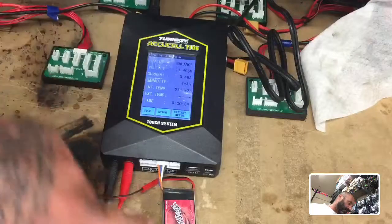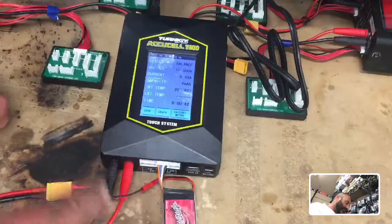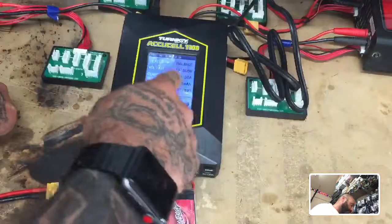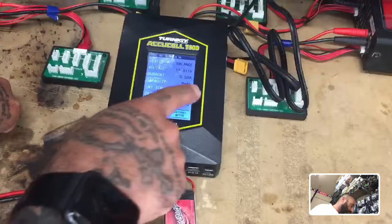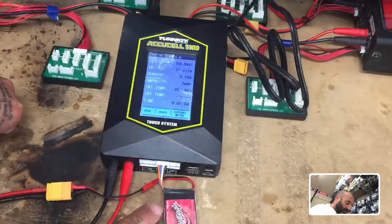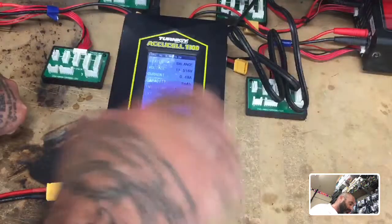So that's how you set this up. Whether you have this charger or the Thunder Power RC chargers, make sure you follow these instructions: don't charge on high voltage unless your battery specifically says it's a high voltage battery, select balance charge instead of just charge or fast charge, and for your charge current the rule of thumb is charge at 1C — so for an 1800mAh that's 1.8A, for a 500mAh that's 0.5A — unless the battery states it can handle a faster rate.